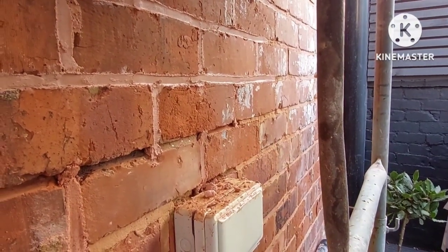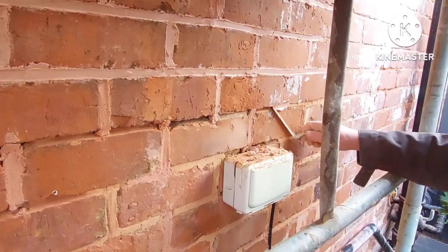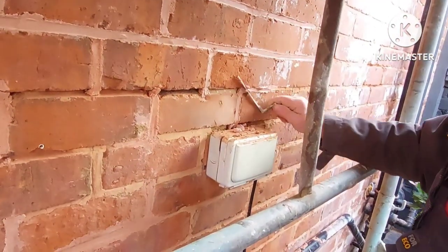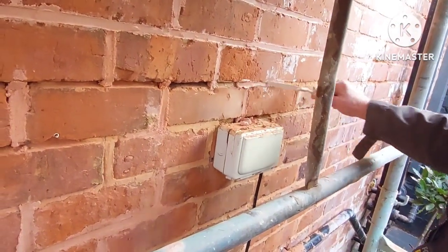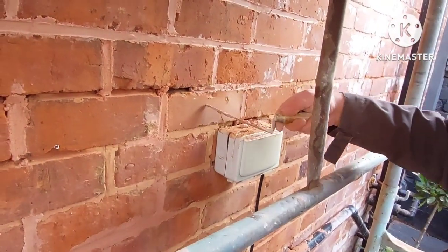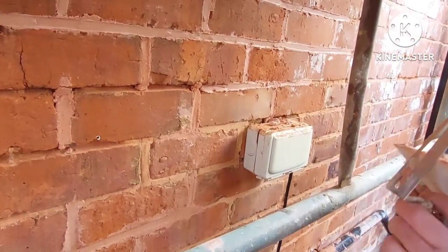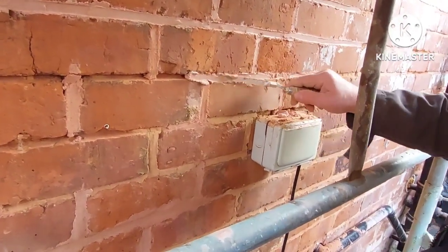Don't forget this is going to be hit with the churning brush — probably in a couple of hours. The temperature's not brilliant today; it's not freezing but it's only about five or six degrees, not very warm at all. There we go — we've got a thin joint there so we use this smaller trowel. This brick here has been changed by somebody and it looks like it's a cement mortar bedding around it, so putting lime around it isn't going to help it much — it won't harm it, but won't help either. Still, it'll look a bit tidier with some fresh lime around it.